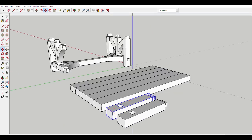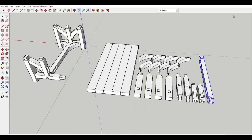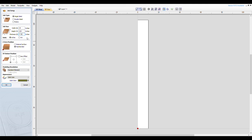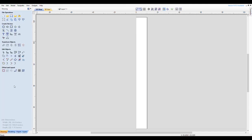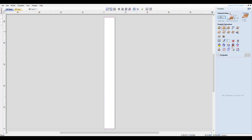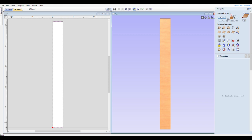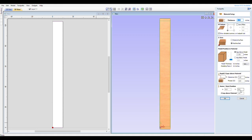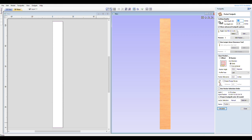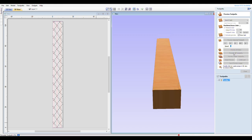Once I had the design finished, I broke apart all the pieces and laid them out in SketchUp. I've been learning some new software called VCarve for drawing vectors and outputting tool paths to the CNC table. I was watching tutorials all summer long while driving tractor, and I couldn't wait to get some time this winter to start using it. I really like the software — it's easy to see how it's built from the ground up just for CNC users. The left side is for setting up your material and drawing vectors and design work, and the right side is for specifying tools and outputting tool paths. It walks you through all the steps so you don't miss anything, and there's a great preview feature plus a 3D view of the finished piece.